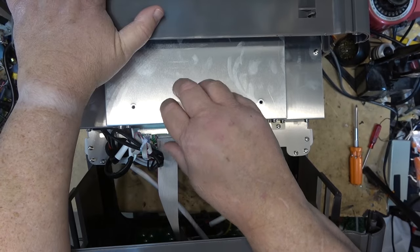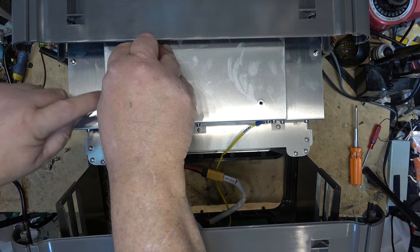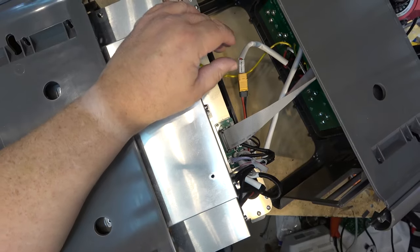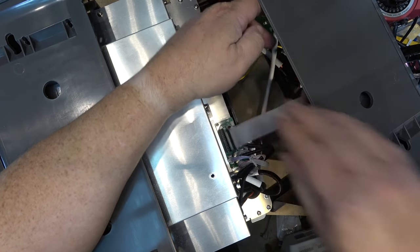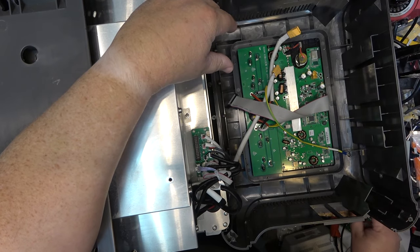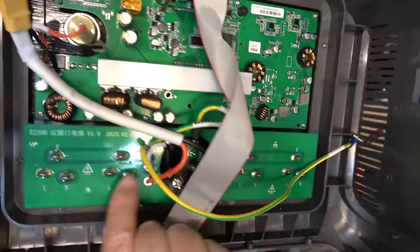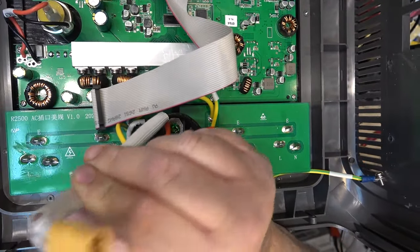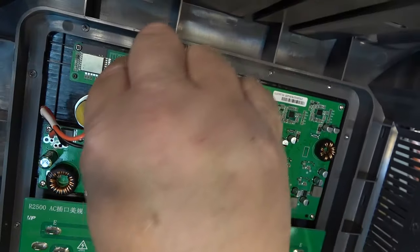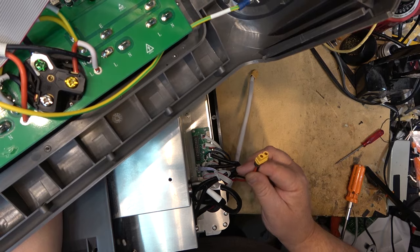As things fall off the shell, we've got a completely shielded inverter with four fans, two on each side. I need to get the back cover off as well. First things first I'm going to unplug the DC and AC power connectors, the control cable, and remove the ground wire so I can remove the front control panel. There's a ground connection, line and neutral, and a big plug for the AC output. The DC is fed from a separate connector — they're different lengths so you can't plug them in the wrong way.